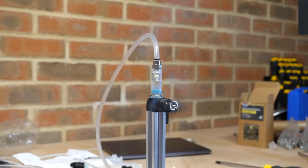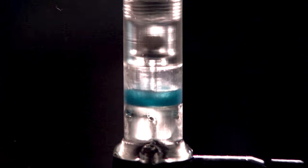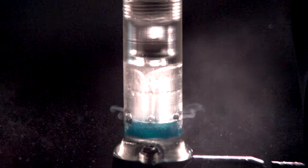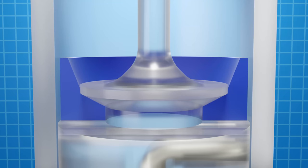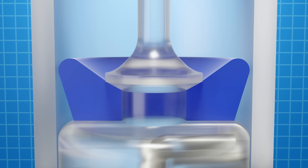It does work, but also requires a lot of lubricant. On the plus side, it seems there is far less air leaking around the piston when the inlet valve opens. It just needs some design changes to reduce the friction. I think the cause of this friction is due to the whole seal making contact with the cylinder, instead of just the top of the flange. So this is the new design seal, which is tapered towards the bottom, and I'm hoping even if the whole seal expands, the bottom portion shouldn't expand enough to make contact with the cylinder.